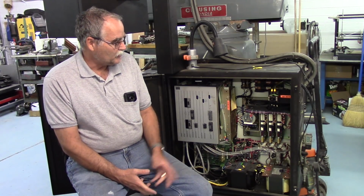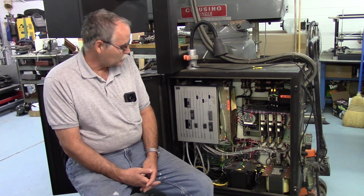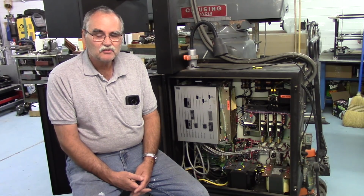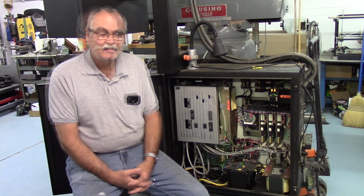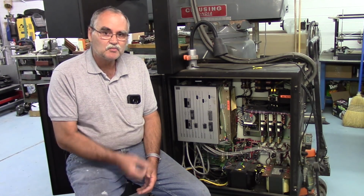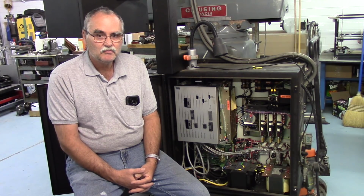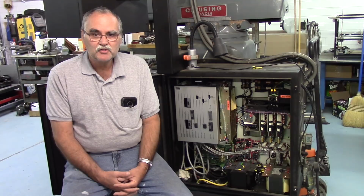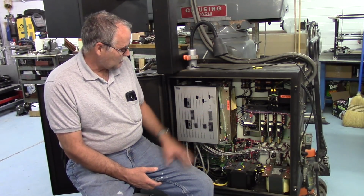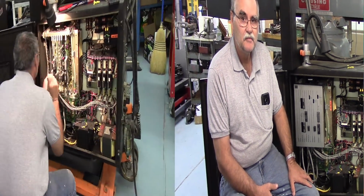So I'll be putting a VFD in here, the Centroid ACORN motion controller, and the DMM Technologies DYN4 AC servo drives. I will use the ZRI for homing the machine as well, so it's as precise a homing as it was previously. It uses the index pulse on the servo motors to actually help home it precisely after it hits the limit switches. So I'm going to go ahead and get this thing all gutted out, and I'll bring you back shortly.